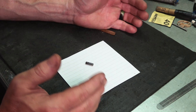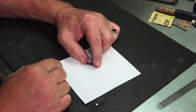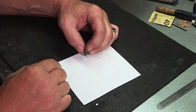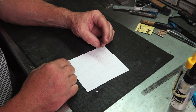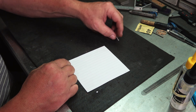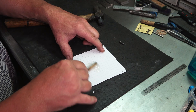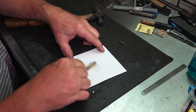I realize that many of you may not be able to braze, so we're going to try the epoxy method. If this were a ball I wouldn't try it, because there's just not enough depth. This rod goes down in there pretty deep and I think the epoxy will work. I've got some long-cure 30-minute epoxy which I'm going to let cure for 24 hours, and we're going to epoxy it into the end of this ball-peen and try it out.